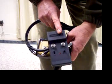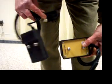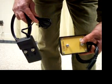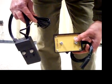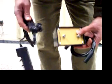Always with the preamp, you have to have a direct run of coax between the preamp up at the antenna and the power supply. Any splitters in the line will cause the voltage to go off one of the legs of the splitters and short out a different TV and shut the power supply down.